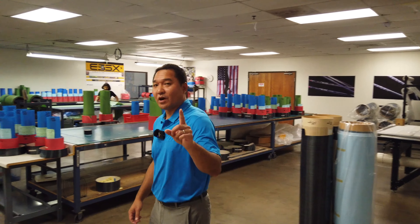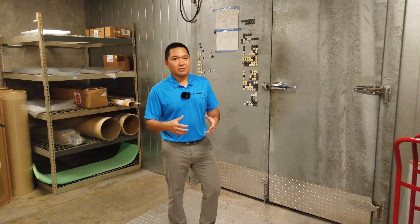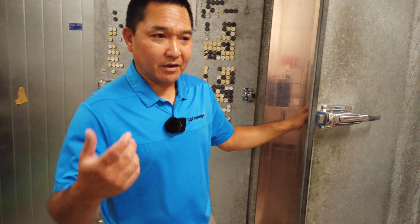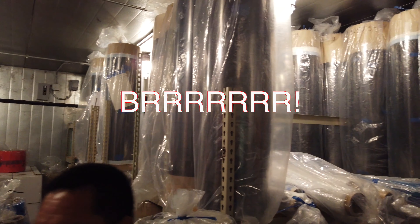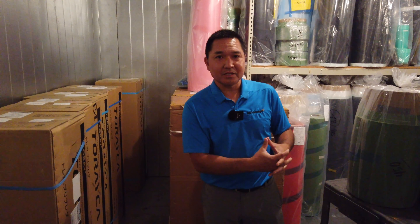Actually, before I show you that, the first thing I want to show you guys is where we get the materials. Carbon fibers and resin require it to be kept cool — if you have them in hot, humid weather, the resin system is going to delaminate and you'll have issues with golf shafts made from that. All quality shaft manufacturers will have a facility like this, focused on getting the best materials from different suppliers. The technicians will grab the materials they need, come in here, and then go to the rolling table and cut accordingly.